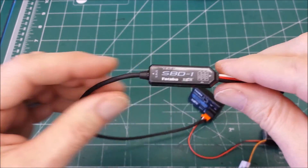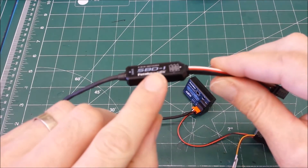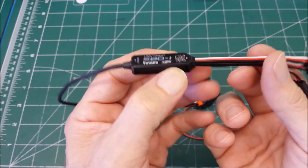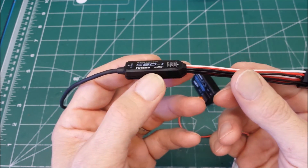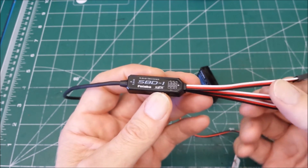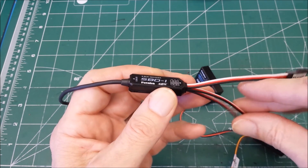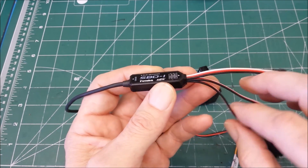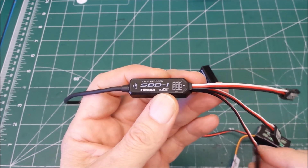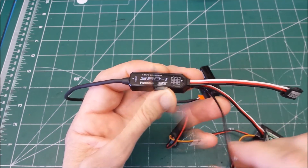I am going to downsize the decoder to fit inside the wing of my F5D plane. That entails removing the case and removing some of the wires and re-soldering new wires to make the decoder smaller. I have already had a peek inside and I know which wires I am going to remove and which I am going to keep. I am going to keep the outlet to servo 1, remove and not use the outlet to servo 2, and keep and use the outlet to servo 3. So I need to program the decoder accordingly to operate the ailerons from outlets 1 and 3.